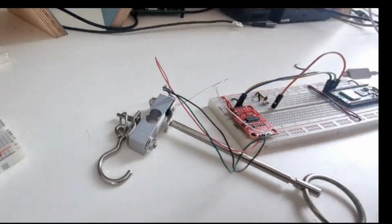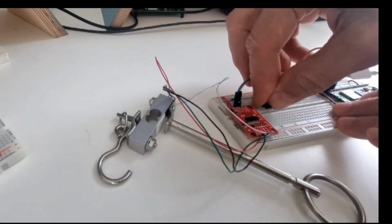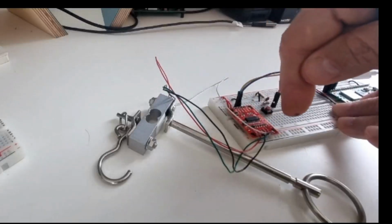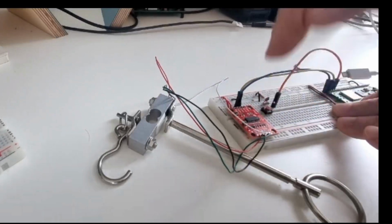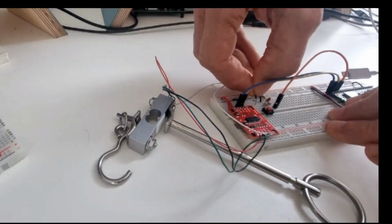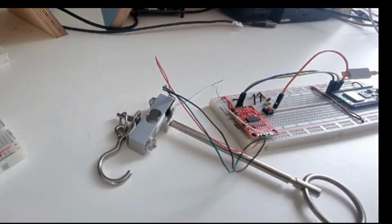And then my button's going to connect the 1K to ground. So button's going to go into there, because these buttons connect this way. So it's got actually two poles on it. But anyway, and then we're going to take the other side of the button to ground as well. So that should be my button debounced.